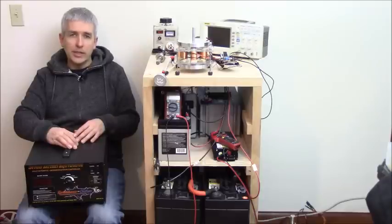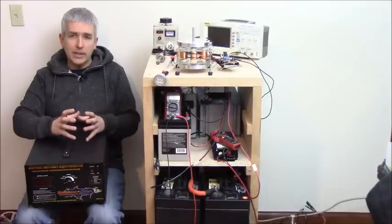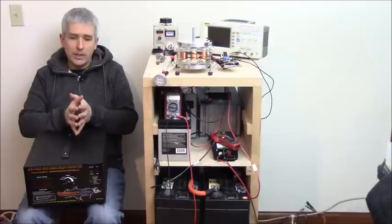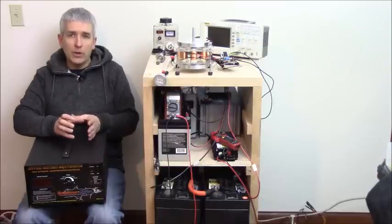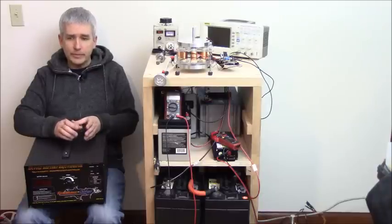There's also a conditioning process with the battery chargers that allows, especially an older battery that has already been sulfated and the plates have expanded, to gain in capacity through a conditioning process that happens in the battery. It's like a foaming effect, where the battery gets more surface area because it's been puffed out. As long as it doesn't crack off and fall to the bottom, which it's in danger of doing if you put a hard load on it, or if you do hard pulse charging to it. And that's what a lot of companies do, because they don't really understand how to properly rejuvenate or charge a battery.